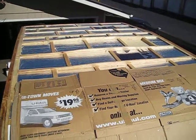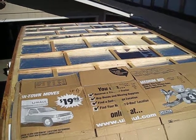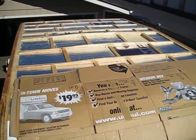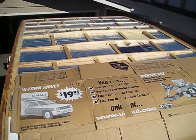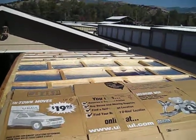We're looking at the roof and the insulation — the one-inch rigid foam insulation. The vent is there to the right, and we have the roof panels sort of ribbed in the center to allow for good water flow coming off of the roof.